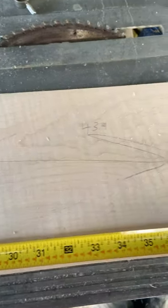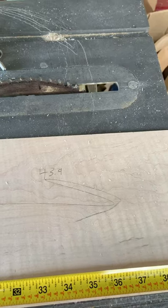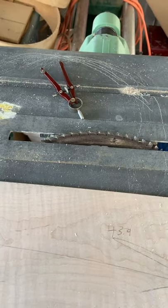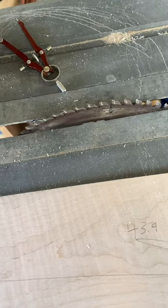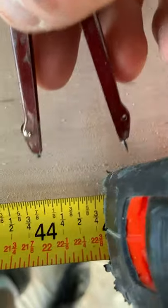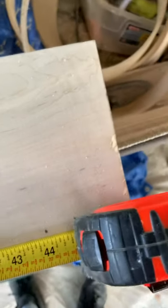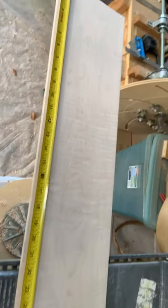For the scarf joint, I like to bend these so the diameter on the outside is exactly 14 inches, so I can remove material down to 13 and 7/8 inches. You multiply that outside diameter — 14 — by pi (3.141592) and you get about 44 inches, 43.9. So I like to mark it at about 44, and from 44 onwards to the end will be the scarf joint.